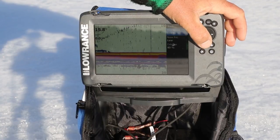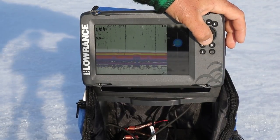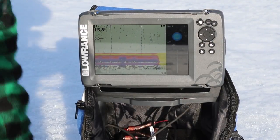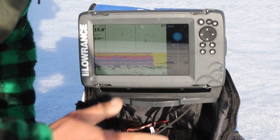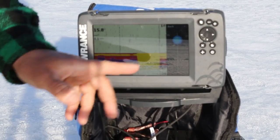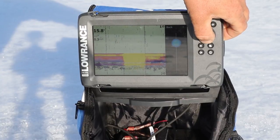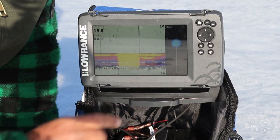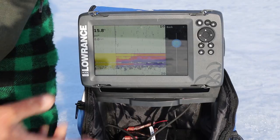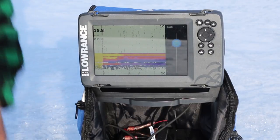You can see this is low now. Then mess with your color line according to where you're fishing and what you want to catch. I'm usually in like the 80 range. The higher you crank it up, the less you're going to be able to decipher what you're fishing for or what the bottom is. Turn it down and you can find a decent level — right here I got it at the 90 setting. Drop it down into the lower 80s and you start to see your purples and reds, which are a really hard bottom. Yellows are a little bit softer. So when a fish comes in, for the most part it's going to come in as an orange, red, and yellow when he's really directly under you.